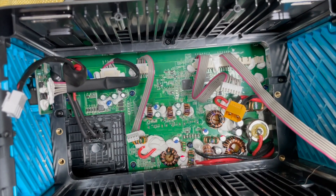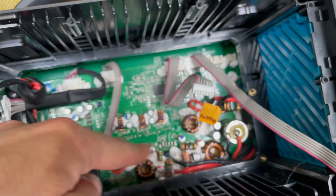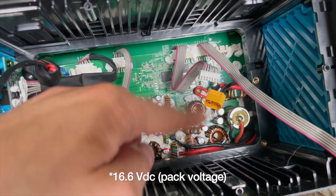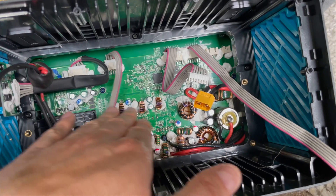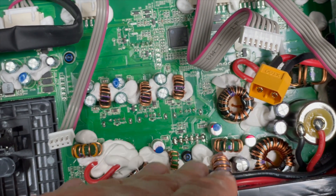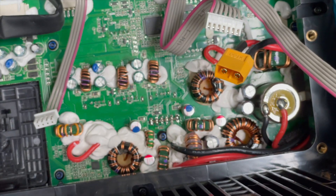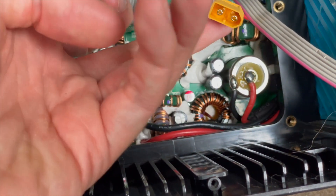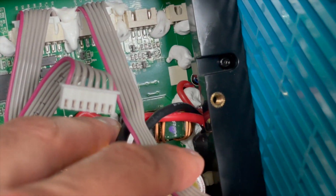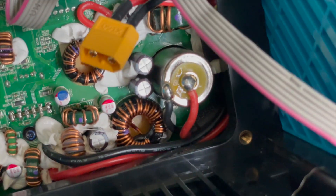Let's look at the inside — the front side, facing all the buttons and control electronics. You've got your outlet down there; it comes through here, goes through a choke and a ferrite, then out to connect to the main inverter PCB. On the rest of the board it looks like 12 volts comes in and gets converted — bucked down to 5 volts through a USB regulator for three USB ports. There also looks like a buck regulator split for the USB-C port and the DC barrel jack input.